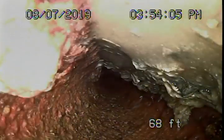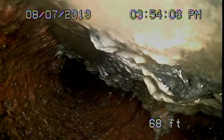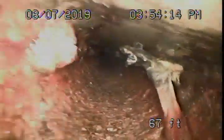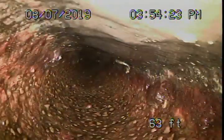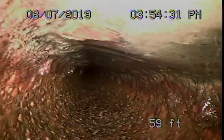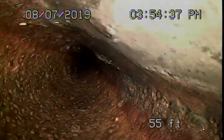You can see how paper and stuff can get caught there. We recommend that you never flush tampons, baby wipes, or paper towels, because you can see how they can catch in the line. The pipe obviously has a lot of rust buildup. At the least, besides replacing the pipe, you should extend the cleanout to the outside of the house and run a blade with a cable through the line.